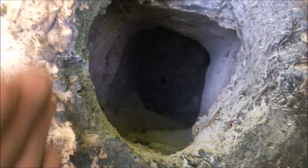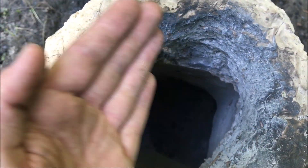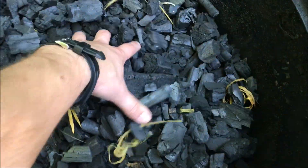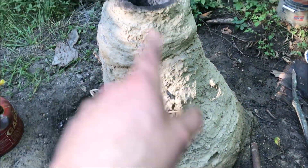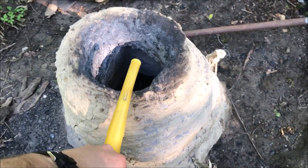Here's a look down inside the furnace. The bottom is kind of shaped like a trough, so the iron kind of slopes down the sides. It gets a lot smaller as it goes up to the top so that the heat is kind of reflected down in there. The air hole comes in at an angle so that the fire swirls around in there as it goes up, instead of just blasting straight up and out the top.